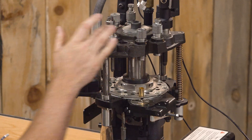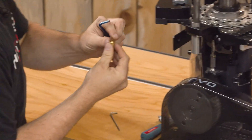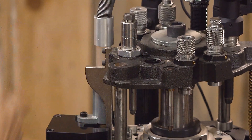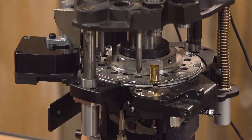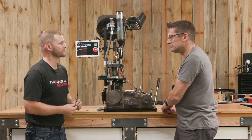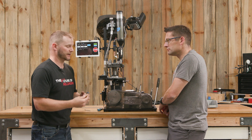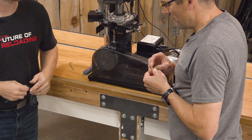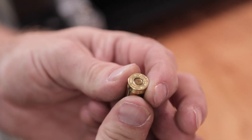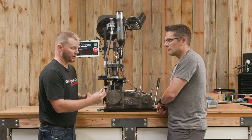So we're going to put this primed case back in the station — we ran the pin down just a little bit. Let's run a single cycle and check our work. We're just incrementally dialing it in — I'm going to go just a hair more to have a little more confidence that regardless of the case we're using, it's going to seat correctly. You can definitely help avoid light strikes if you get that primer all the way into the pocket. I shoot competition a ton — tens of thousands of rounds a year — seating them below flush to about 5 thou. SAAMI spec is flush to about 8 thou. You don't want to go much past that. Tell me if that should help prevent some light strikes. We can also examine the condition of the primer: if it's marked up or looks flattened by the primer punch, we'll want to back that off a little because we are damaging the primer at that point.